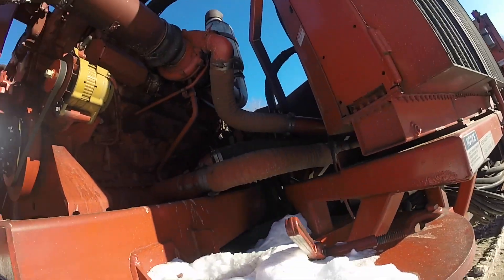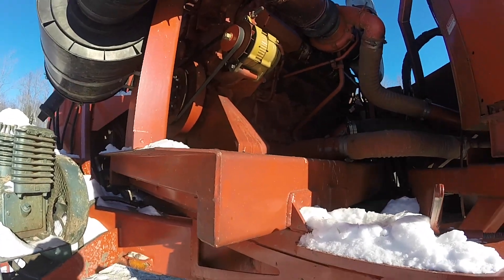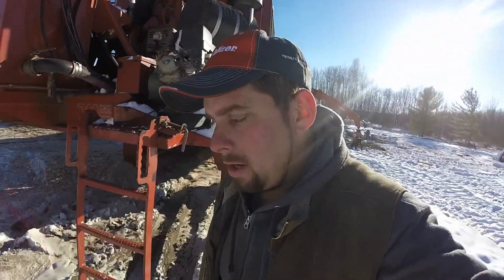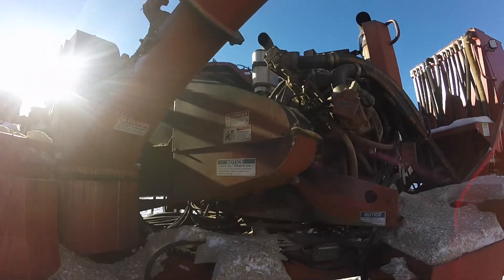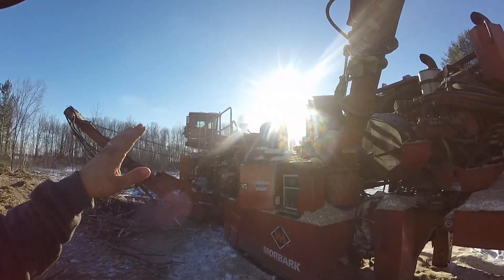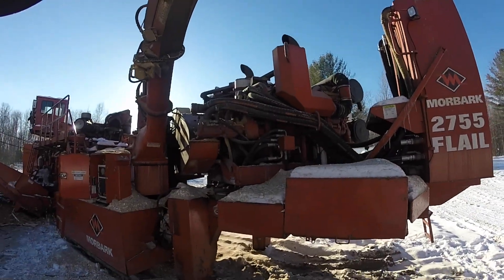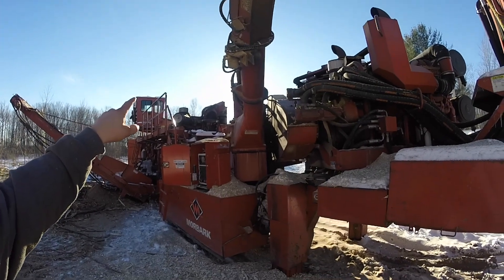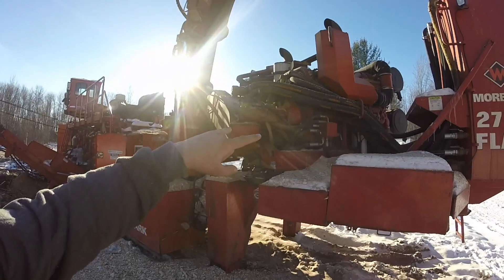The radiator is there so you got a hydraulically controlled fan. But those dual starters are absolutely wonderful. In the old chipper, what happened a lot was you're constantly fighting that V12 to start on cold mornings. I was reading like 4 or 5 degrees this morning. One problem we had was we couldn't get this V12 started — that was always a big hassle trying to start that big motor in the cold with our old chippers. And we got this new one, and the V12 starts wonderful in cold weather. It's the little motor that gives me a hassle, and it all goes back to them dual starters.